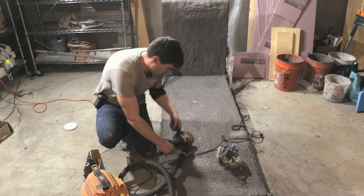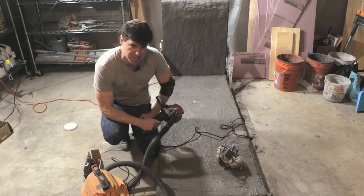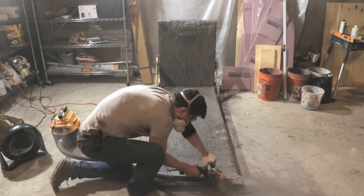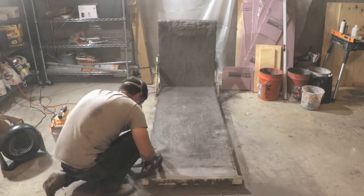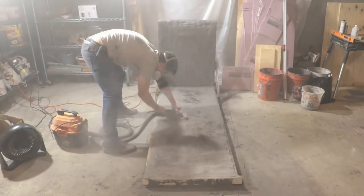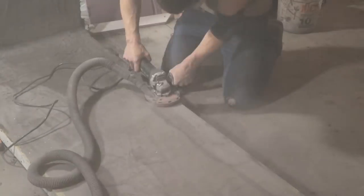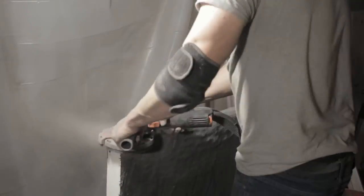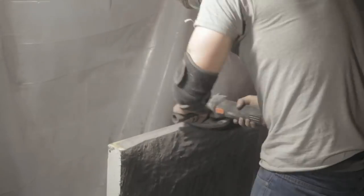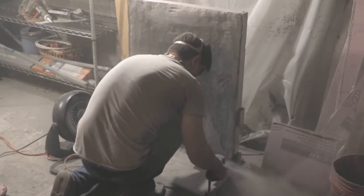Because the mix wouldn't level on its own, we're going to use an angle grinder — TacLife Tools sent this to me to try out — with an inexpensive diamond cup wheel I got off Amazon, link in the description. The TacLife grinder and diamond cup wheel cost under 50 bucks together and worked really well, so it's a good inexpensive combo. Before demolding, I ground down the base of the waterfall flat so it would sit nicely on the floor, and also ground the face and inner corner of the waterfall so it would fit nicely around the cabinets.